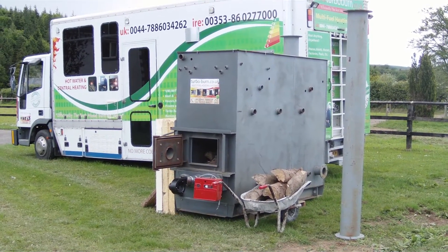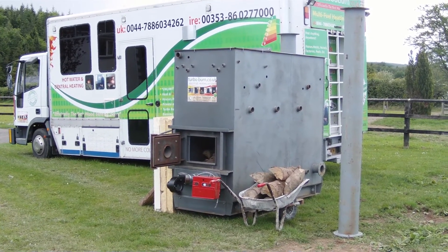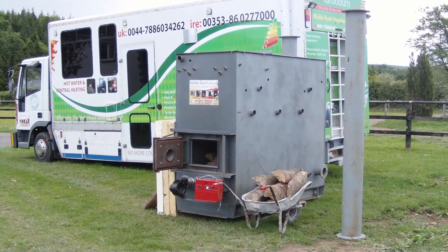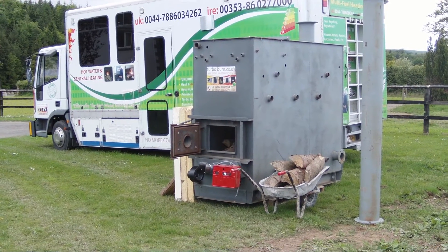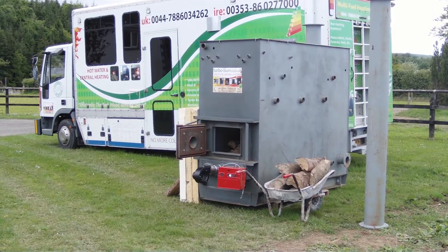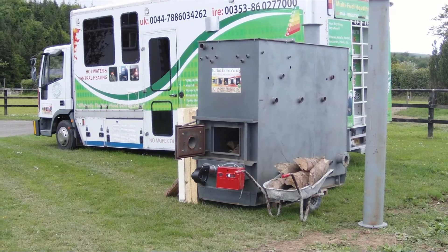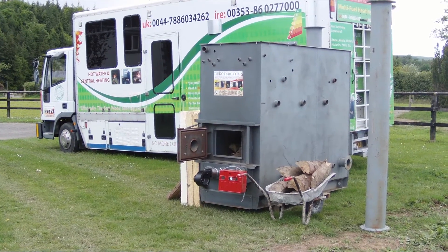On the right-hand side we have a steel chimney that sits on top, bolted on — usually two sections are used in all installations. About three to four barrow loads of firewood will heat a tank of 700 gallons from cold. So you can have it hot tonight at 90 to 100 degrees, and the next day when it's down to 50 or 55, you go out and light it up again.